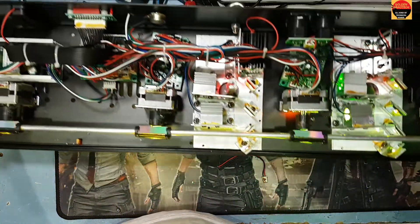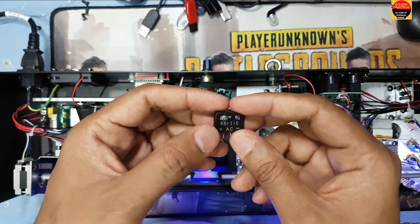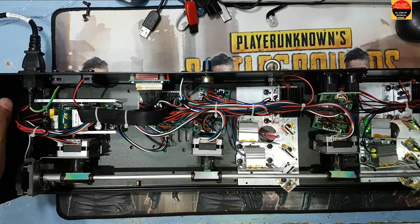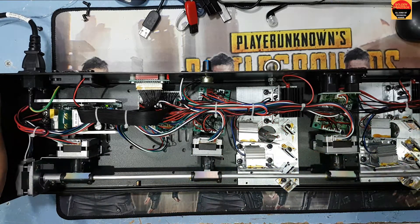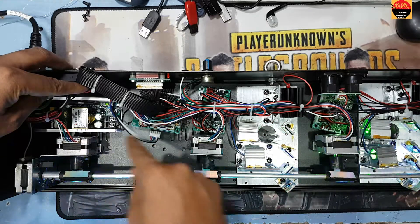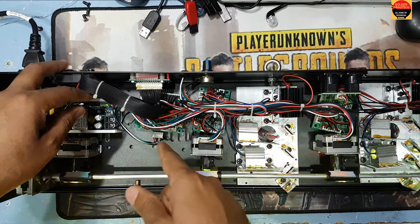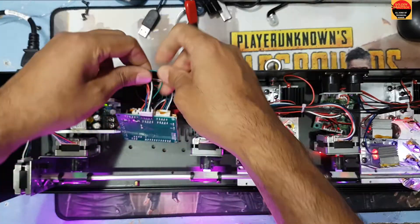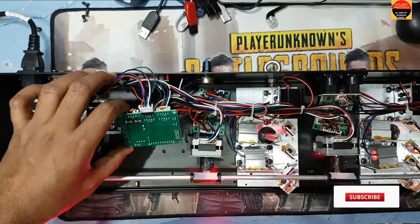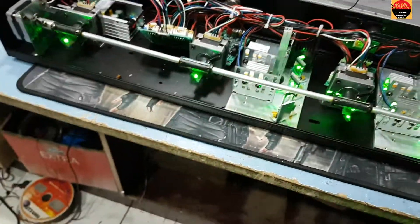This all connection fault was this bridge — this one problem, you can see it's damaged. And now it's working perfectly. So thank you guys, please like, share and subscribe my channel. If your laser light has no power or problem, first check the power supply DC volt output 12 volt. Here was the bridge for AC 12 volt to DC 12 volt, that's why the problem. I made it direct and it is working perfectly now. Please like, share and subscribe my channel for new videos.